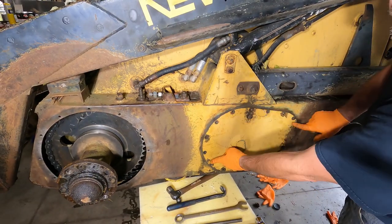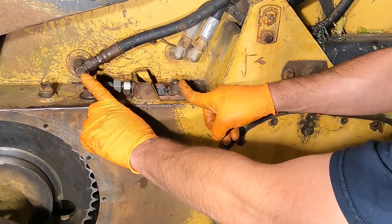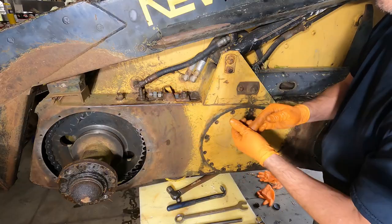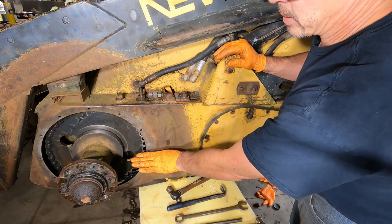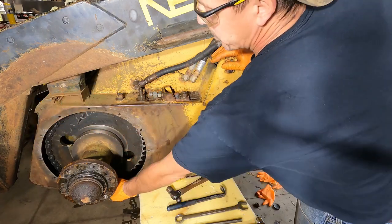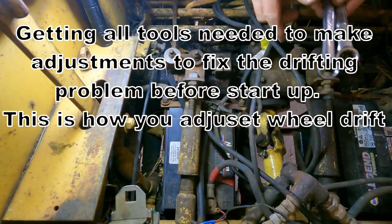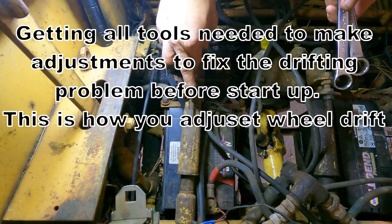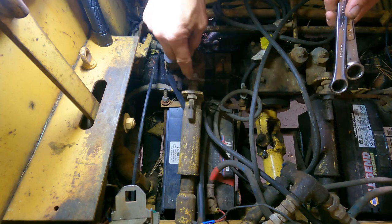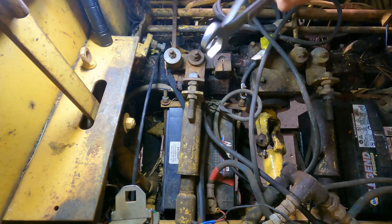We're gonna put this cover on, probably just 2 bolts is enough, and then we'll also adjust this till I think it's tight, lock these down to the 10 foot-pounds, and then leave that little gap like that, and then we'll be good. The other way they say to do it is to check the tension at 0, 90, 180, 270, and 360. Because the left side drifts, the left side spins, we need to go in and make our adjustments here. So we wanna back off these two. All right, and I'm looking at a manual, so.